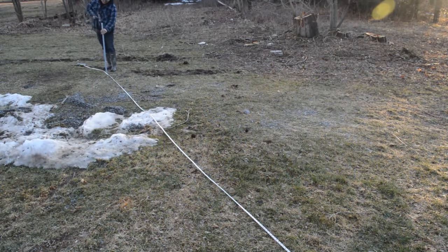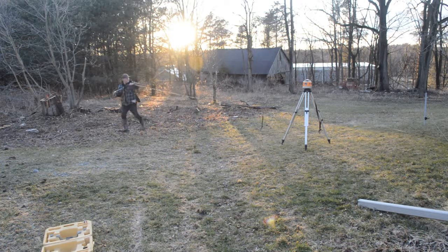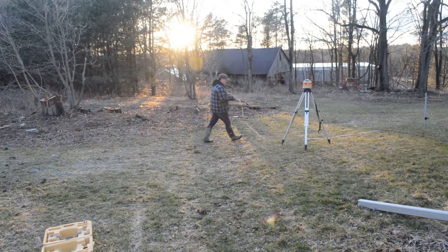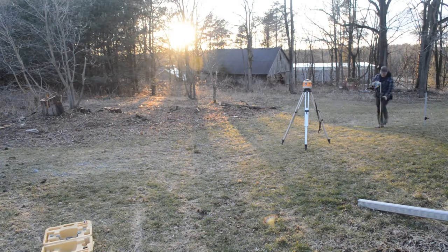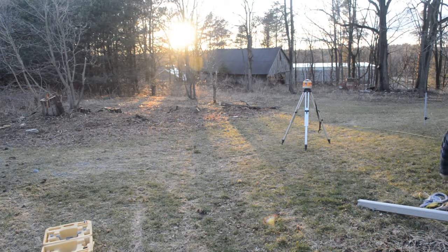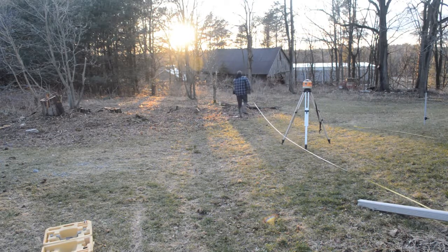So the layout is starting. Here I am pounding a steel post in the ground — this would be the second corner off of the house. I got the third and fourth corner working on that right now, laying that out. That's just some measuring, following the blueprints. Measure corner to corner to make sure everything is sitting there square. This is laying everything out for the excavation. Right now we're above grade — we've got to put the footing in below the frost line. What that means is we have to make sure this building is below the freezing point of the ground. So when the winter comes around and the ground starts to freeze, we want to make sure we're below that. If not, that freezing will push the foundation of the house.